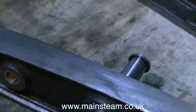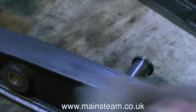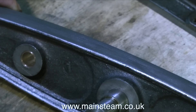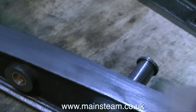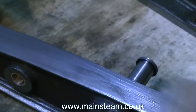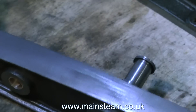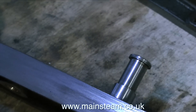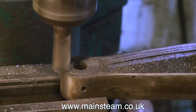Well, it is at one side; at the other side it's still a bit wonky, which puzzles me somewhat. It's not really important, because the two holes at the front of the beam are also out and they're hidden by the parallel motion linkages. In a similar way, the lack of concentricity on the pump rod side of the hole will also be hidden by the pump rod linkage. Whereas originally, at the front of the engine — the bit you look at most of the time — that hole in the beam was horrible. Now at least it is bang in the center of the casting.